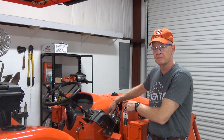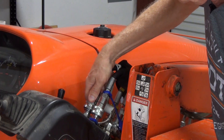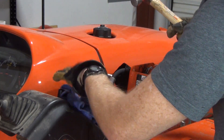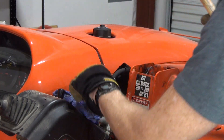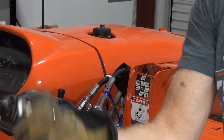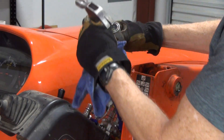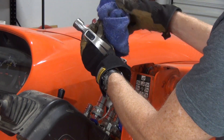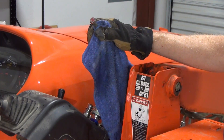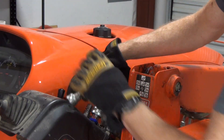That connected up really easily. But on occasion, even though you relieve the pressure with the joystick after the engine is off, you may find there's some extra pressure built up in the hoses and you can't connect them — but there's an easy fix. If you find the couplers won't reconnect, you can relieve the pressure on the male end with a hammer and a rag. Place the rag over the male connector and give the tip a sharp tap with the hammer — if you can push the tip in by hand, you've succeeded. For the female connector, you'll need a bolt — a 3/8 inch bolt 3 inches long or similar will do nicely. Place the end of the bolt on the connector tip in the female connector, wrap the rag around the bolt and coupler, then give the bolt a solid whack with the hammer. You should be able to connect the couplers now.